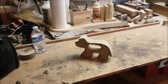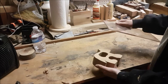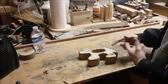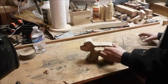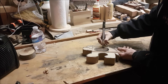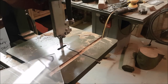Now that we've got that done, basically the last thing we have to do — other than finishing — is to put a piece of plexiglass or acrylic on either side. If you really want to, you can put a piece of wood there, but you're just not going to see what's inside. The whole point is to kind of see what's inside. Take your marker and draw around the inside of the circle like that, then cut this piece out using the band saw or your coping saw — both will work.